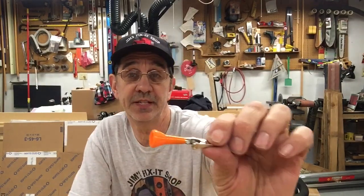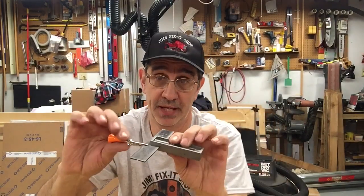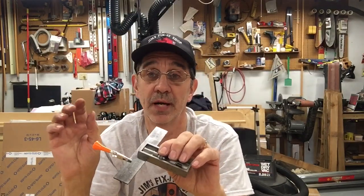First thing you want to do — if you look close at this alligator clamp, you can see some white material down inside. That's a piece of Kleenex or paper towel. Stuff it down inside the hole about halfway so it plugs the bottom where the wire is supposed to go through. Then take one of these medium-sized tips — you have to run a little drill through it to open it up a bit so it fits in there. Mix up some epoxy and drip a little down in there. The epoxy is thick but it does run, so if you don't put the Kleenex in there, it'll run into the joint and the clip won't work.